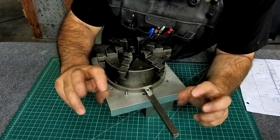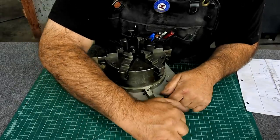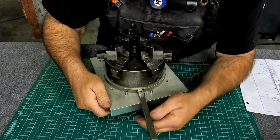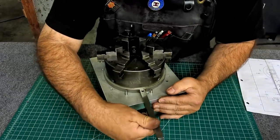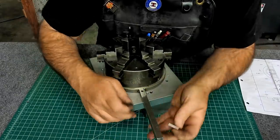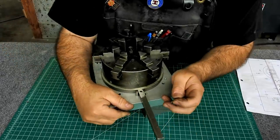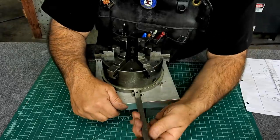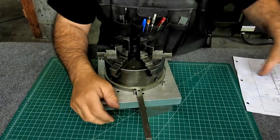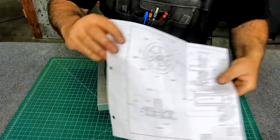And I just machined them by hand, and I actually use this lever to guide the cutting. And these stop pins that you see here represent the end positions of those curved slots, right? So that's one side. And then if I swap these over, put this pin in here like that, now that's the stop for this side, which is up here, and then this is the longer slot here, or the outer radii in this case. Go back to this. So that outer radii and that inner radii, okay?